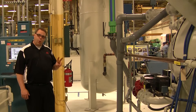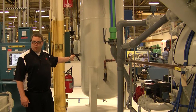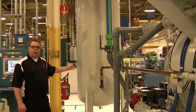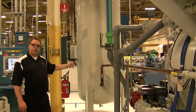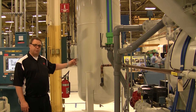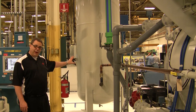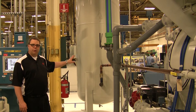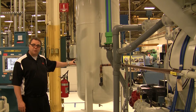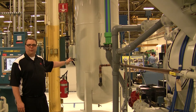There are two fundamental ways of purging this tank. One is the old tried-and-proven method — very time-consuming and very expensive — called purge-pump, purge-pump, where a customer will fill the tank with inert gas, backfill the furnace, pump it down, backfill, pump it down, repeatedly, in hopes of purging the air or oxygen out of the tank and replacing it with inert gas. This method works, but it's very time-consuming, very expensive, and not really the preferred methodology for ensuring the tank is free of air.